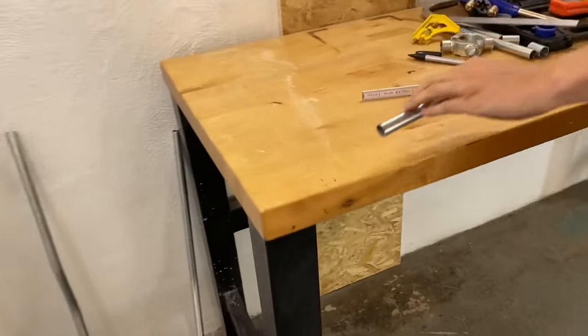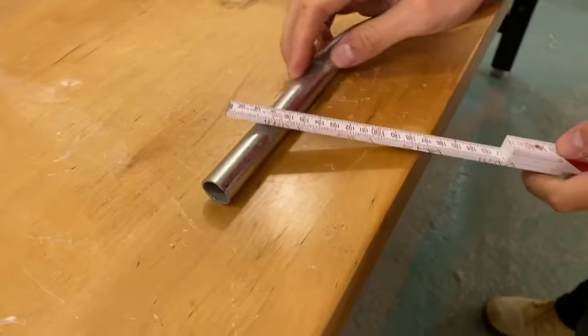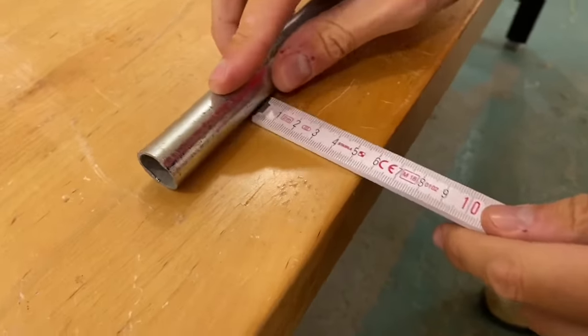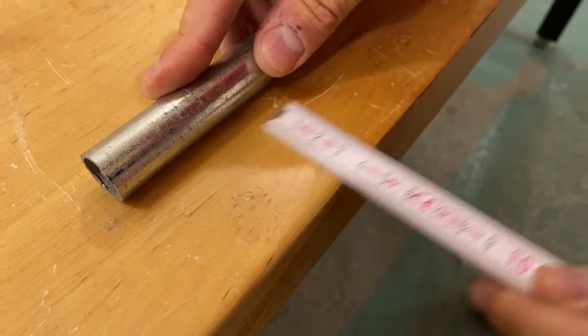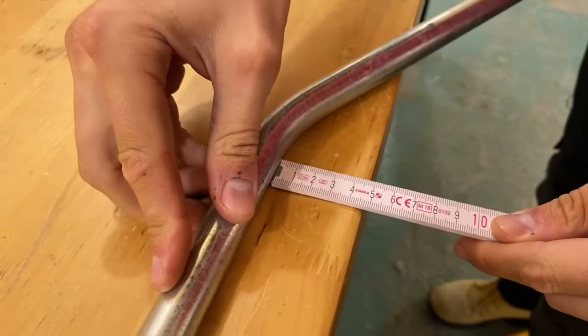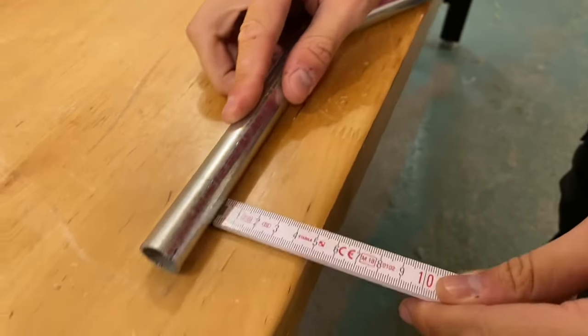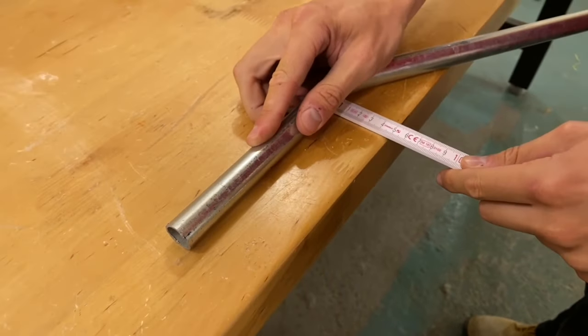Now we need a straight edge. I'm going to measure 50mm from the edge of this table — so the bottom edge of the table to the bottom of the conduit is going to be 50mm. I'll check it at this end again. Yeah, that's always crucial because obviously you could dip down, which it did do. So we're 50 there and then back to the first one. So that's going to be a 50mm set.